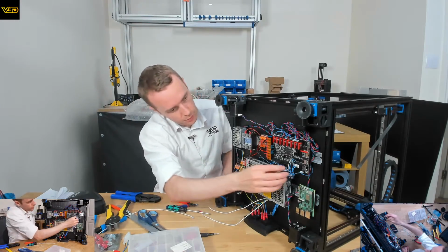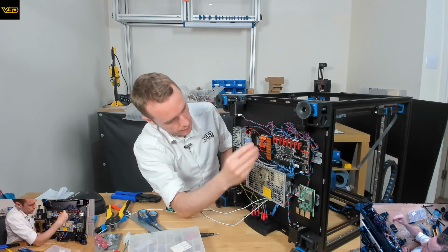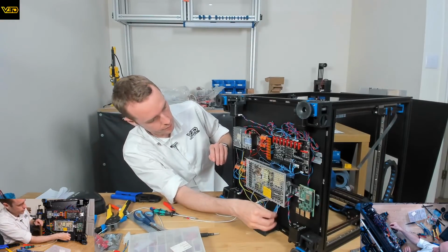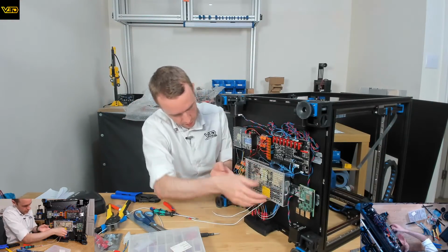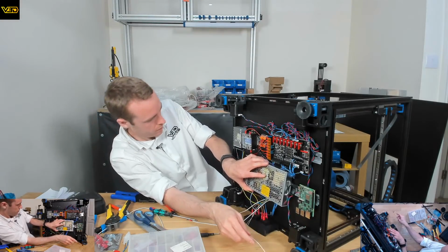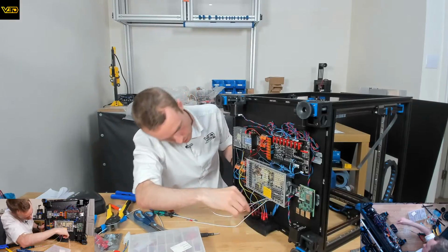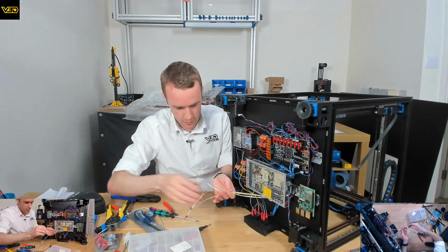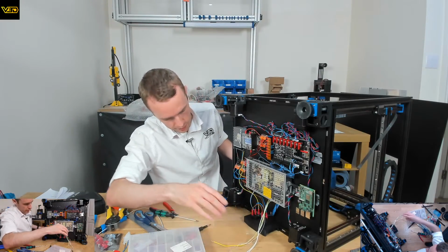And the bed thermistor is the other one that's got to come out. This is less ideal, isn't it, now that I've tucked that behind the power supply, because the connector doesn't fit back through. Back up. Which way is this one? So that, oh, and earth too, that's another connection. So you've got live, neutral, earth, thermistor. That's all the bed stuff, so that can now be removed.